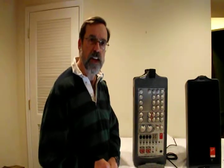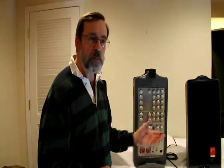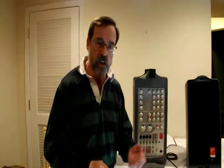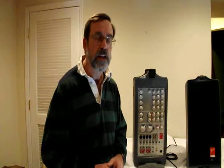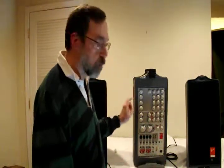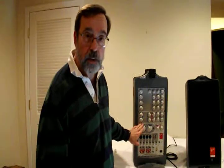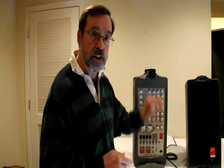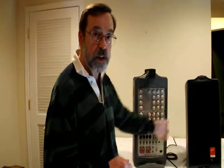There's one exception: it's very common for musicians to show up with guitars they want to plug in after the room is set up. You don't have to power down the amp for that — just mute the individual channel they're about to plug into, so any pop as they make the connection doesn't get past the mixing board and into the amp.